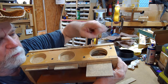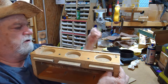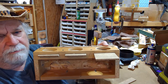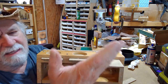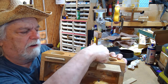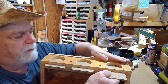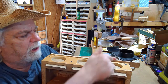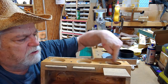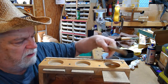You put a bottom on it and the slot created by the shorter piece is where you seal it completely so no vacuum leaks through. Pull that short piece out for the clean-out. For the blast gate itself, take the top piece and make a dado the width of your blast gate and the depth of your blast gate's thickness. Make this dado all the way through the piece so it comes out the bottom. When you sandwich the two pieces together, you push the gate in and it'll come all the way through and out the other side. I put a pin in mine to stop it from pulling out the top.